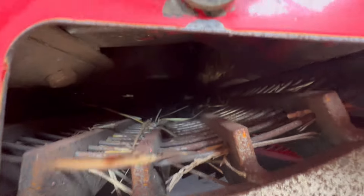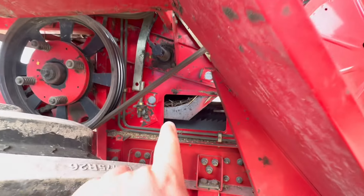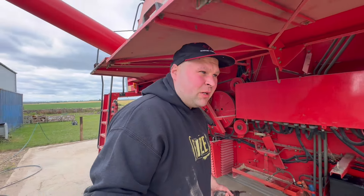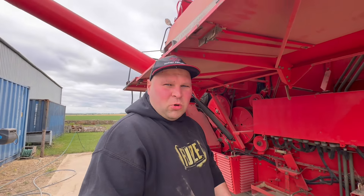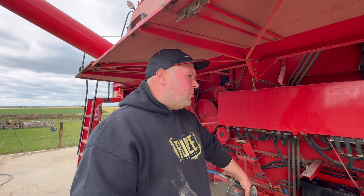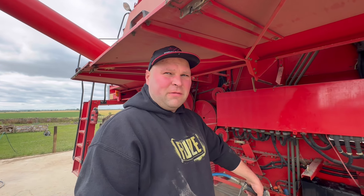We've stopped it now. More of the inside — that's the bit that separates the corn and the drum bearings, so we need to grease them. Let's give it a wash first. We don't want to pressure wash it after harvest because all the water sits in the bearings and doesn't do it a lot of good, and it can sit in the electrical bits. So we don't wash around any of that bit really. Usually you wash them a week before harvest.